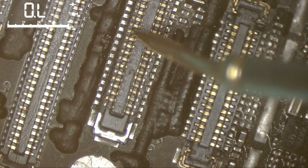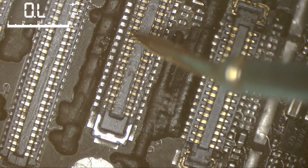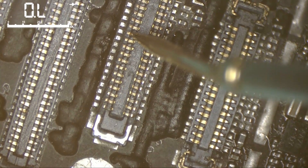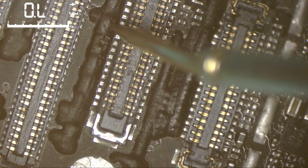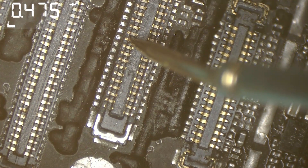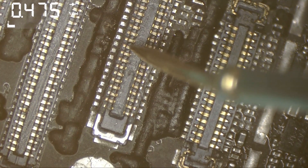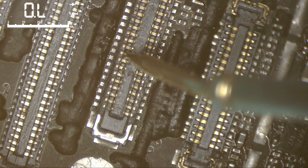I had a feeling that these MIPI filters are loose and I was correct. Here there is no resistance — it should be 470 ohms. This leg is connected to that coil and I guess that coil is loose. Yeah, resistance came back again when I touched it.